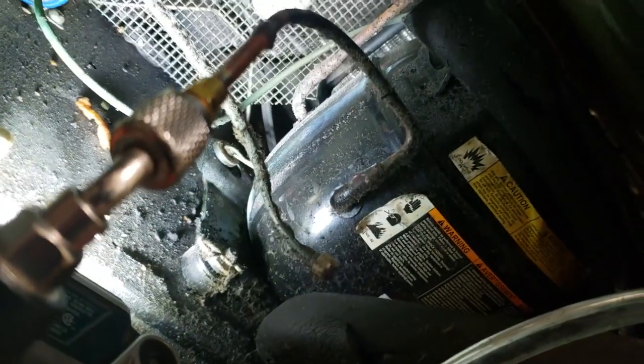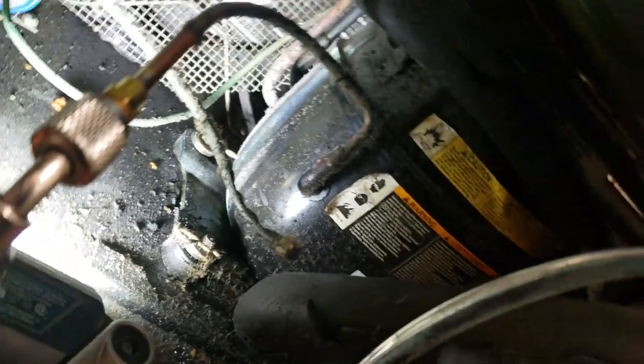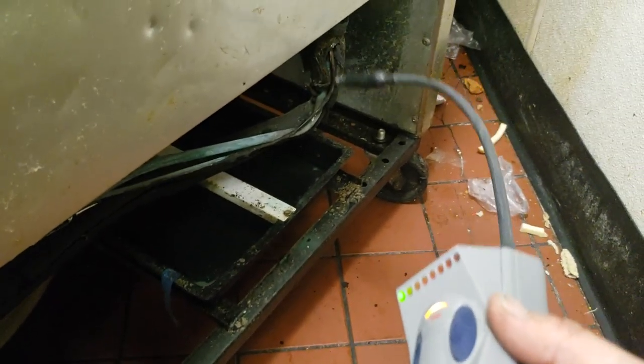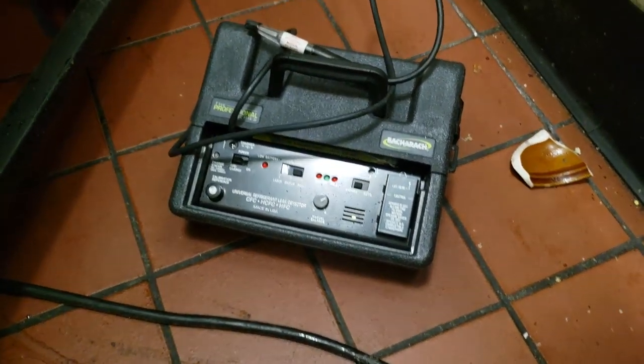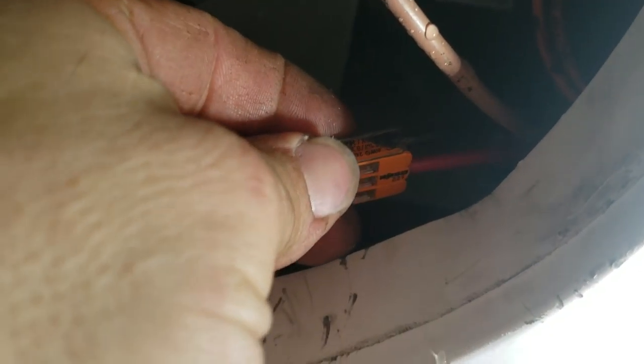Getting all up in that suction line and I don't know where it got it from. I guess I'll re-scan the evaporator because I thought it was probably trailing down the suction line and coming down below. Just scanned it with the H10 and even the ultrasonic and I didn't pick up anything. Just reused some of those clips from the thermostats we replaced before. Got that and that — it pushes back out of the way and they're protected with technically OEM fittings.